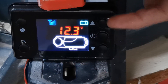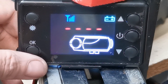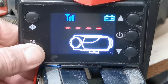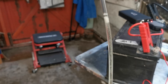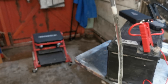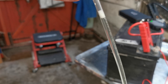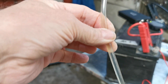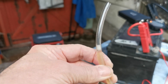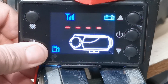Those up and down buttons are for setting your heat up and down. Now let's prime it — quite simply, press and hold the OK button. You'll see it flashing: a fuel tank icon and the pump. You can see it pumping fuel up. Don't worry about cavitation bubbles from the pump, that's normal. I'm getting near the end of the tube now — that is enough. Stop it there. To stop priming, simply do the same thing again — press and hold.